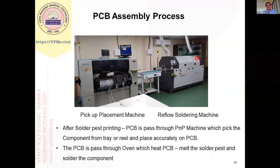There are also some components which have to be done manually. This is a photo of our production line where we manufacture our product. Here is a pick-and-place machine and this is a reflow machine. Since these processes are not fully in-line, there is a lot of material handling, and that's why we need to consider what care is required in material handling.